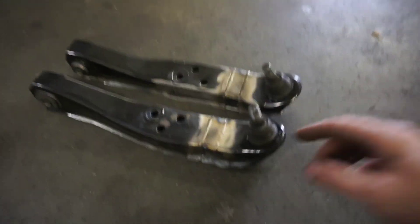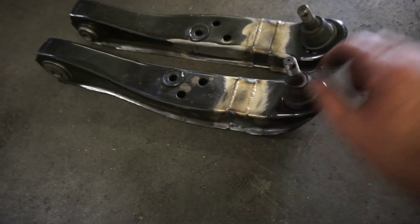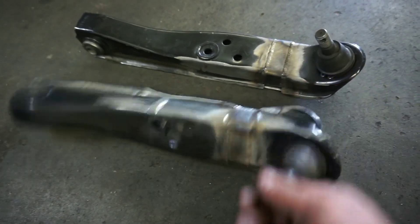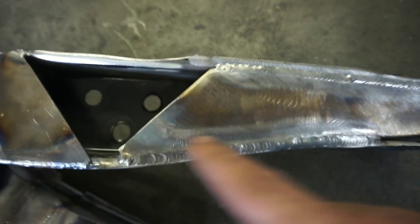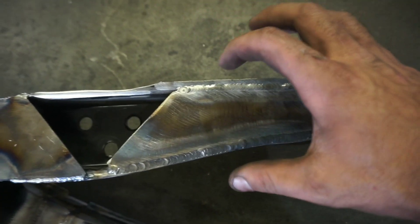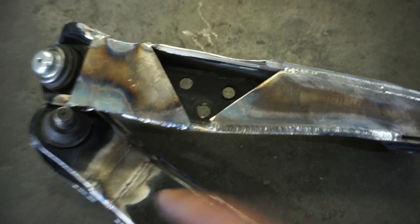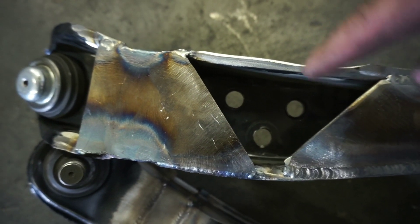As you can see in that last clip, I was welding out the tops of these. While the camera was charging I went ahead and welded out the plates on the bottom. These don't have to be anything super specific — you pretty much outline the general shape with a marker and then cut it with a cutoff wheel or a bandsaw.